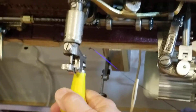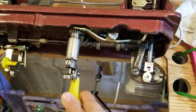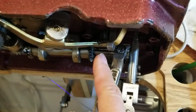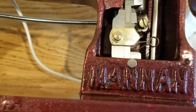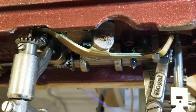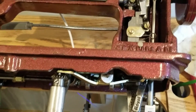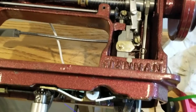Let me zoom out here. Pulling up and down on the handle, the little rod is going up and down through the handle. It's hitting this lever, it's going over here. This piece right here is part of the end of this piece up in here. So this lever here is rocking and it's pulling the stop-motion up and down. That's how this works, and I have another video that shows you how to disengage and engage the stop-motion with the machine running.